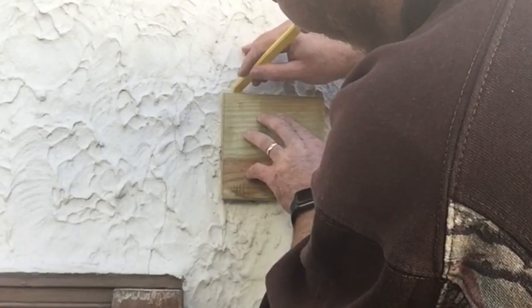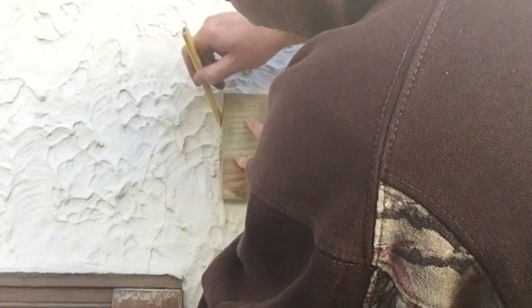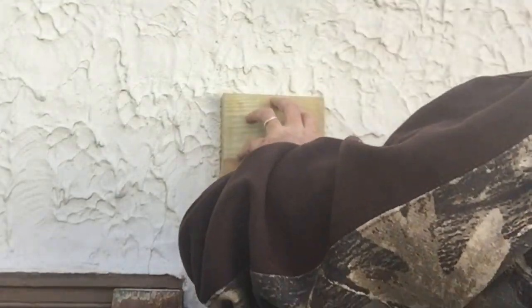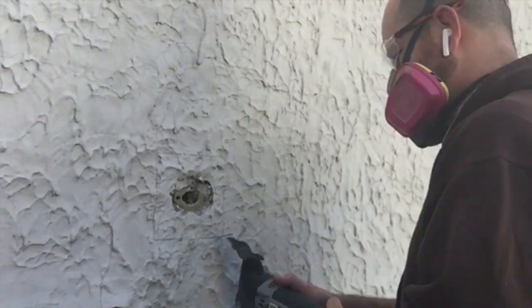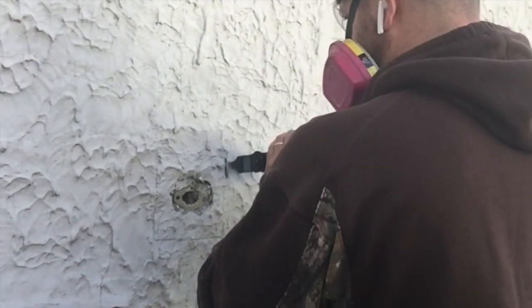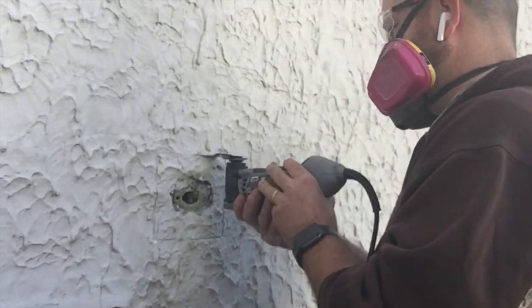After that, I used a treated piece of lumber that I cut to 5 and a half by 5 and a half inches. This isn't kiln dried, but it had been a scrap piece of wood in my garage for a long time, so it was dried out. Making sure you get a dried piece of wood is very, very important, and you want to make sure that it's treated.